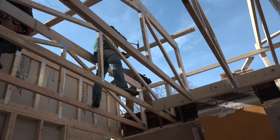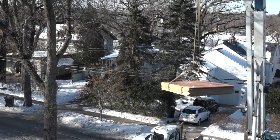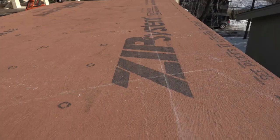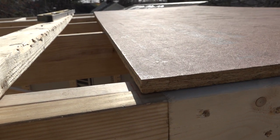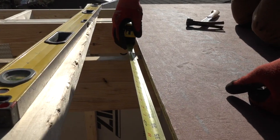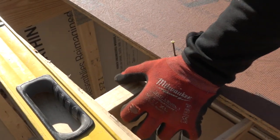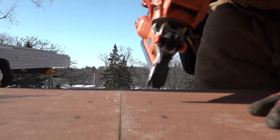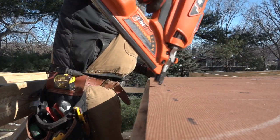Now they brace the top quickly and toenail the bottom to the line snapped on the top plate. Next comes the Zip System roof sheathing. On such a flat roof, running roof sheathing is a lot like running subflooring. Begin with a line snapped across all the rafters and keep the sheets parallel to the edge of the roof. Put the corner of the Zip panel on the line and nail it. Pull layout from that first nailed rafter marking the sheets so that the rafters maintain correct spacing. The end of the panel should split the rafter. Keep doing this until you either run out of sheets or run out of roof.